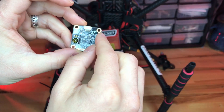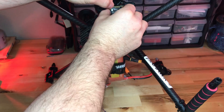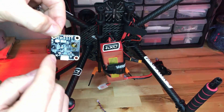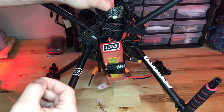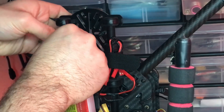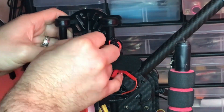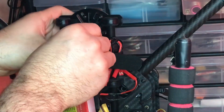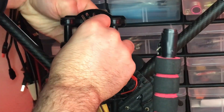There's a little XY reference there. It's going to look something like this where the connectors are pointing towards the back, and there's also one on this side as well for reference. You want your optical flow and distance sensor pointing down, so you want it in a downward orientation. I'm going to go ahead and mount that up there.